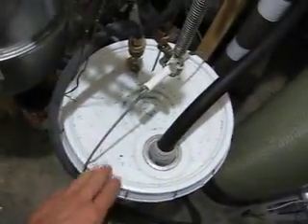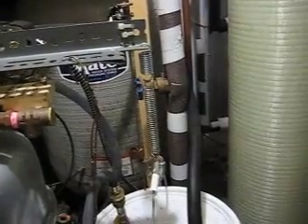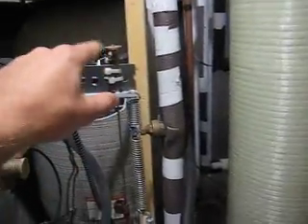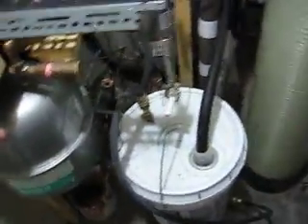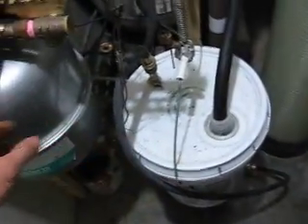The antifreeze is stored without being under pressure in this five-gallon tank here. It's on a spring, and the spring stretches more and more depending on how much antifreeze we have. If there's not enough antifreeze, it's not very stretched, and the switch up here will be off, so nothing will happen — I'll have to come back and add antifreeze into this big tank. This whole system allows me to not only put antifreeze in automatically when the system runs out, but also when I want to drain the boiler, I can drain it into here, or into a tank that ultimately gets poured into here, and then pump it back into the system without wasting antifreeze, which is kind of expensive.